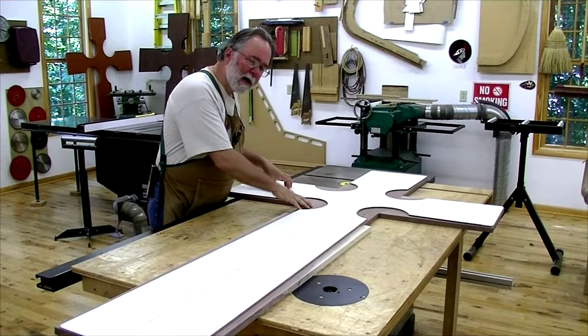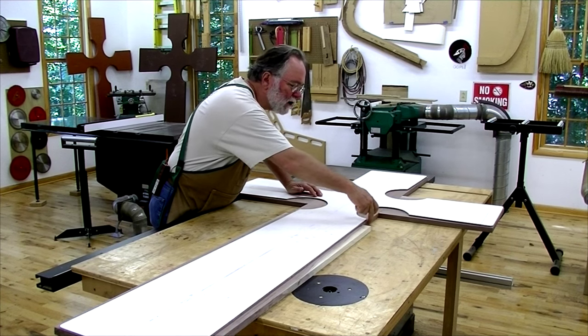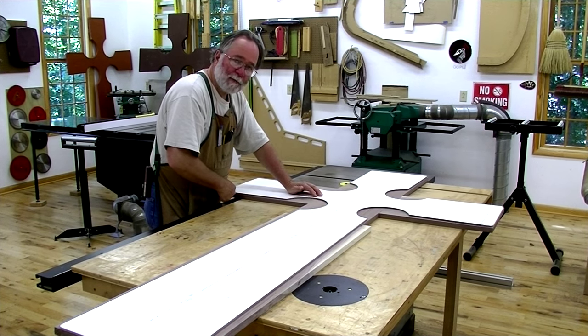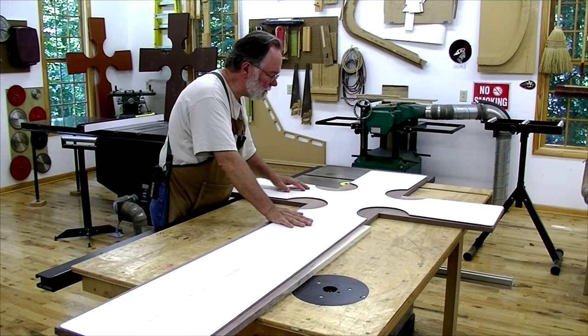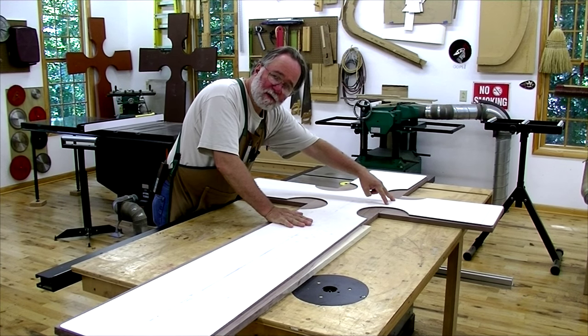I'm making the bottom layer of the walnut, so I've cut away from the vertical part and made two side pieces that'll go in here. I'm using my pattern to make sure I have placement right, and then I'll go ahead and do some domino tenons to attach them.